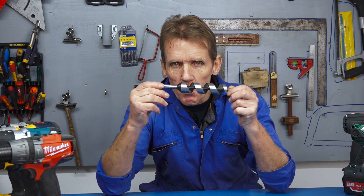The next bit we're going to do is the torque drive test with the self-feeding auger bit. We've got a 32mm bit here and we will go higher — we'll try to eliminate them and see which ones survive on the high-torque setting. I've got my suspicions of which ones will be better, even based on what I was just doing. For this test we put it on speed one — the lowest gear in every single instance — and we'll just see how it goes and which one survives.